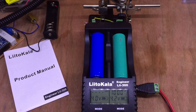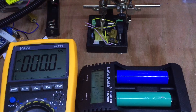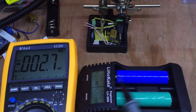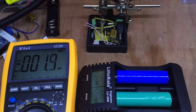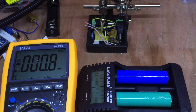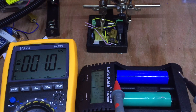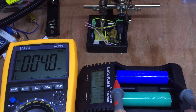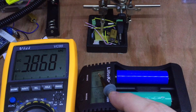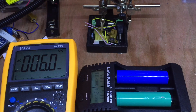I want to check whether these voltages are accurate. This cell claims 4 volts. I got my meter and was struggling to get the probes in without covering the screens. Testing it: 4.03 volts on the meter versus 4.0 volts claimed - that seems fairly accurate.